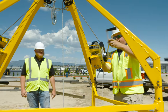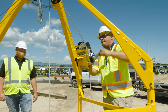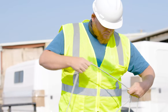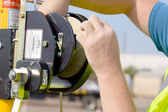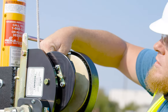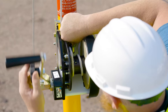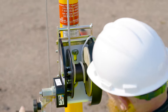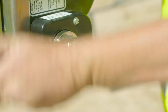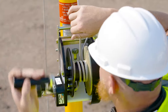There are two quick and simple ways to attach the rope to the hoist drum, depending on what kind of rope you have. If you have rope with a looped end, first remove the thimble from the end of the rope. Then pass the loop through the hole on the reel, going from the inside of the hoist to the outside, and simply slip the loop securely over the rope hook.